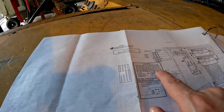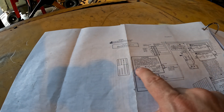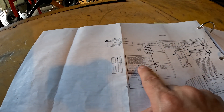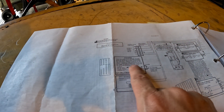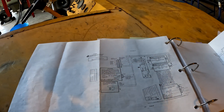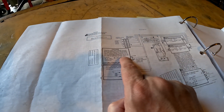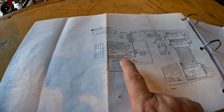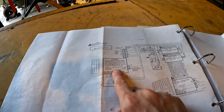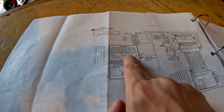I checked that breaker — it's not popped out — so the right-hand 28-volt DC isn't coming through for us possibly. Now if that breaker is popped or the right 28-volt DC isn't working properly, that means right here, to prevent possible overload of 3T414 — that ground power transformer rectifier — it'll blow the fuse. Both of which have been happening: the fuses have been blowing and we have overloaded this transformer rectifier, which is the one that burnt out the other week that you saw us replace. So that wasn't in the troubleshooting steps. This box is very revealing for us — we're going to track down this right-hand 28 volts and see what's going on.